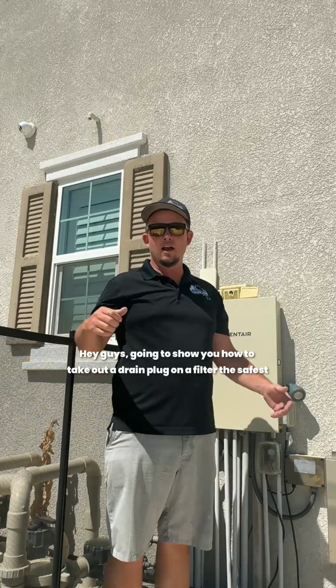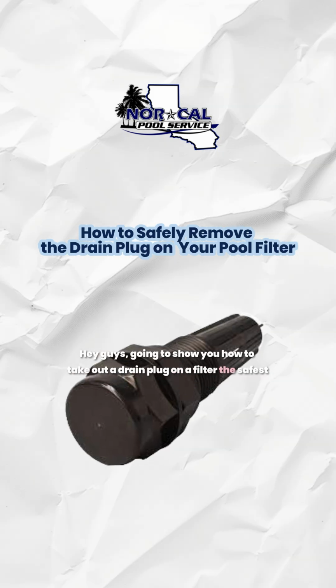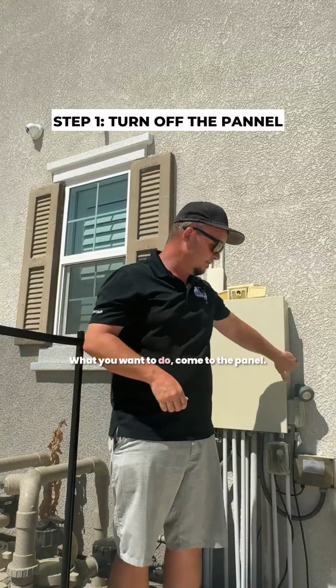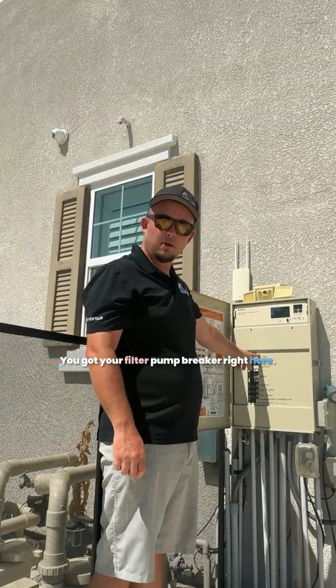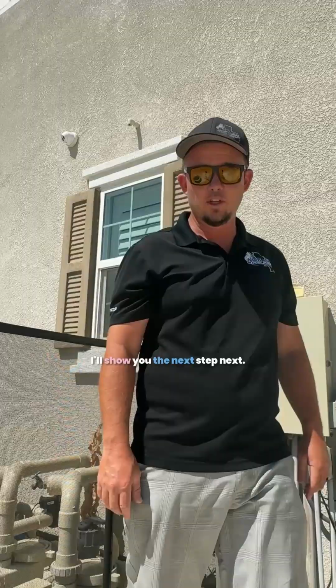Hey guys, going to show you how to take out a drain plug on a filter the safest and best way possible. So first things first, always first things first. What you want to do, come to the panel. You got your filter pump breaker right here. Turn it off. Pump has to be off at all times. I'll show you the next step next.